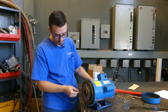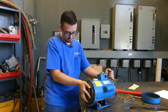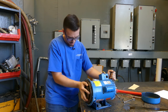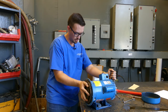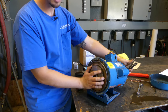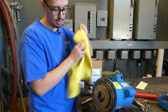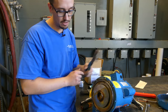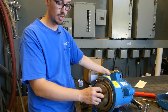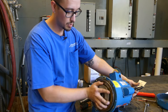We got that nut out, and I think the impeller also threads on. We may need a strap wrench. We were able to loosen it — we didn't have much to grab on to so we just threw a cloth over this and then used our channel locks. We just want to be careful not to damage that profile, because otherwise you're going to have some pretty bad wear.